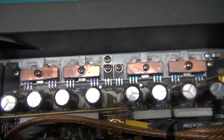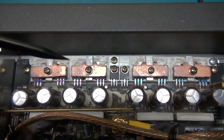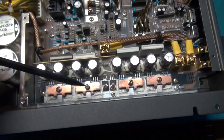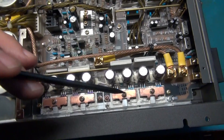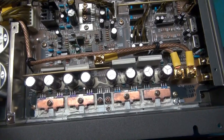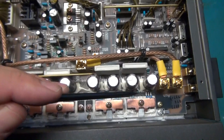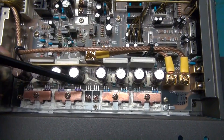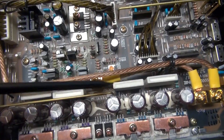I've color-coded these purple and blue. The IRF9540s and IRF540Ns create the bottom swing for one half and the positive swing for the other half. These resistors are your source resistors that combine all the FETs on that channel so they all contribute to the same output and take up a little bit of the discrepancy between them.